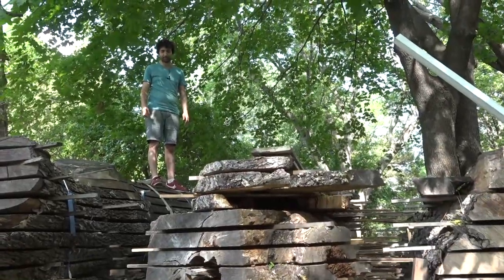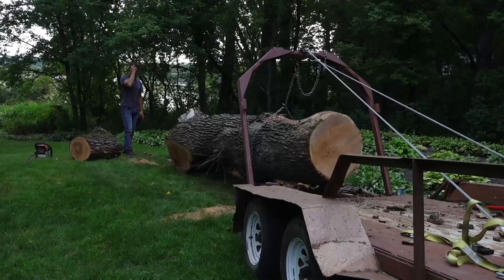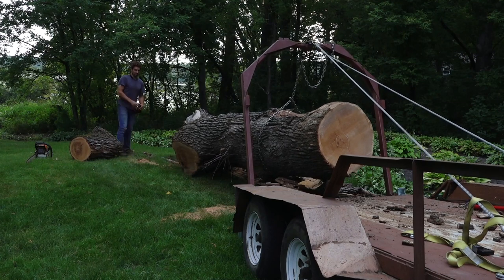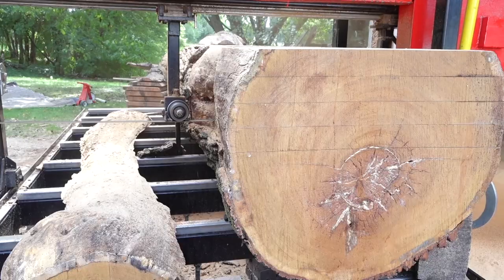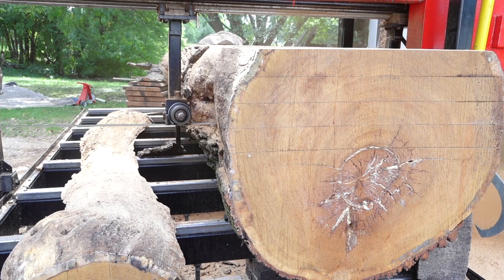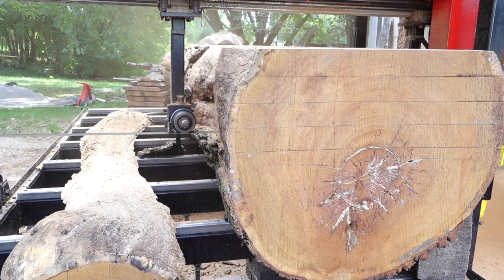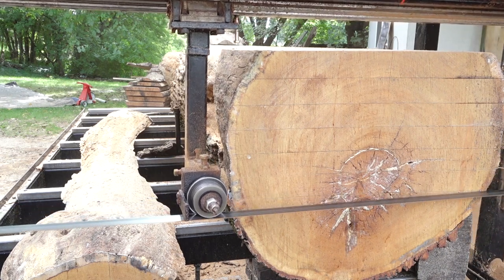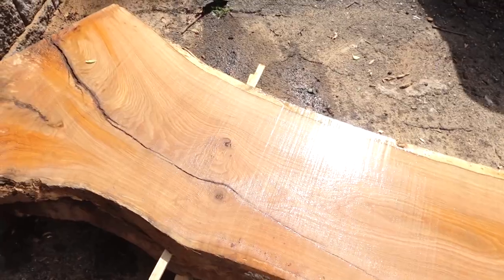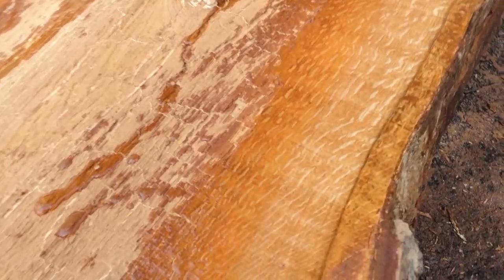On top is a rotted-out white oak log I cut in August of last year. Those are also still up in the upper 20s moisture-wise, so still quite a long time to go before fully dried. A common question I got on that video was: since the tree was standing dead for so long and somewhat rotted, was the wood already dry when it fell? And no — trees aren't really dry standing up like that. This thing is still fully saturated, almost as if it were a brand new tree, still holding a ton of moisture.